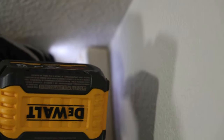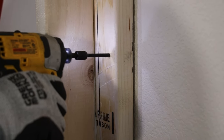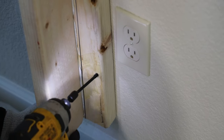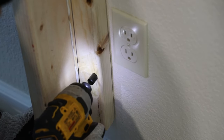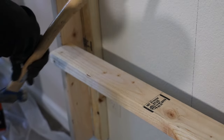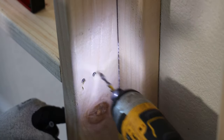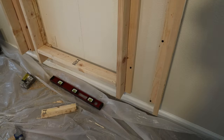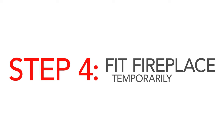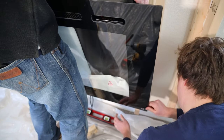Level and install the 4 L-shaped frames by attaching the 2x6 part of the L flat against the wall with framing fasteners along the studs you marked on the wall. Level and hammer the 32-inch crossmember into place 11¼ inches above the start of your first row of GenStone. Temporarily insert the firebox into the opening just to make sure that it fits.